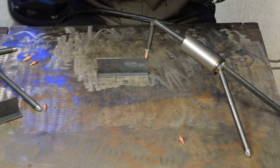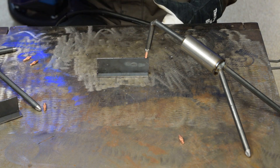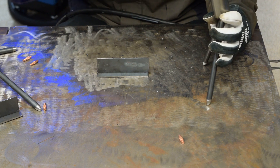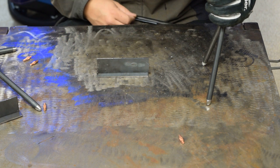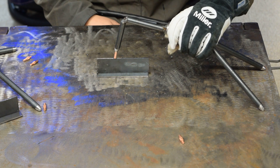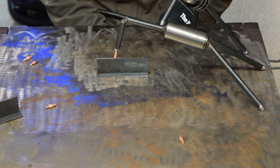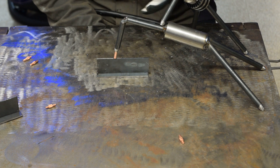That's really the nice thing about these third hands — not only does it give you the ability as a beginner to hold things more accurately, but it's also a nice little weld project to start with. All you need is just a few pieces of material. It's not too complicated: cut some round solid stock, some smaller pieces and large pieces, grind the ends together, tack it up and weld it. It's a good beginner piece, and you will find it's a very useful tool to have. Not a bad project to start with, and something I'd recommend to every welder. Thanks for watching, and we hope to see you in the next video.